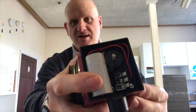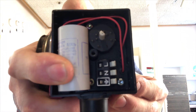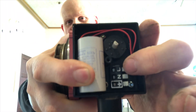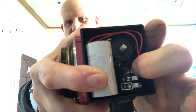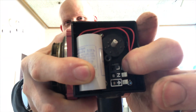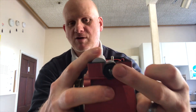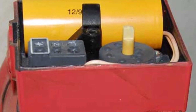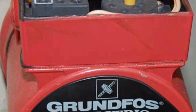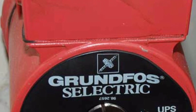The electrical connections on this pump are incredibly easy. We've got live, neutral, and earth. These have little pull-back tabs — as I pull the live back you can see the little gate opening, and that's where you put the wire. Others have a little plug where you undo the screws and plug it back in, with the wire going through this grommet. The yellow object in the photograph is a start capacitor, which holds energy allowing the pump to use that energy on startup.